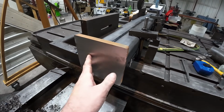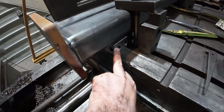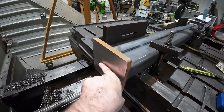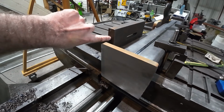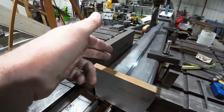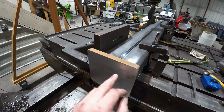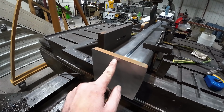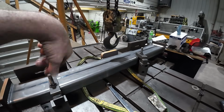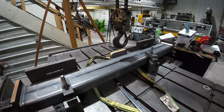All right, so before I started facing all these, I indicated and set my zero off of my angle plate here and my 2-4-6 block. So I have my height, and then I had to come up half the distance of this box tube to get center, but I also have to indicate a 1/4 inch off of the angle plate because the zero is actually a 1/4 inch from the end of this box tube. So set that zero, and then we start drilling our holes, and it gets 4 holes on each end, and then a 1/2 inch drilled and reamed hole here and here. And then we flip the part around, but I also have to orientate it, so when I rotate it around, obviously this plate will be over here. I need to roll it, get this plate back over here so that I'm exactly the same again both ways.